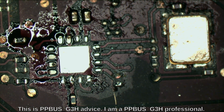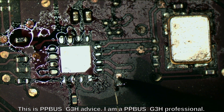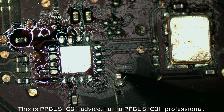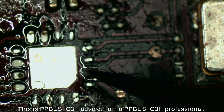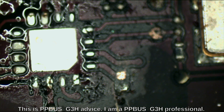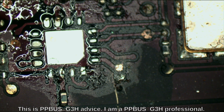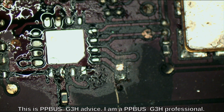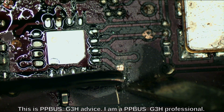You can see that it wouldn't have just worked by being re-soldered because it's all corroded right underneath that pad there. So I'm just going to scrape that a little bit with the tweezer. Will Apple serial lock every component with ESD4? I don't know. But if I wind up being part of Right to Repair legislation being drafted, I'd want to focus on avoiding that being the new reality. You can't lock out people from being able to use other parts.